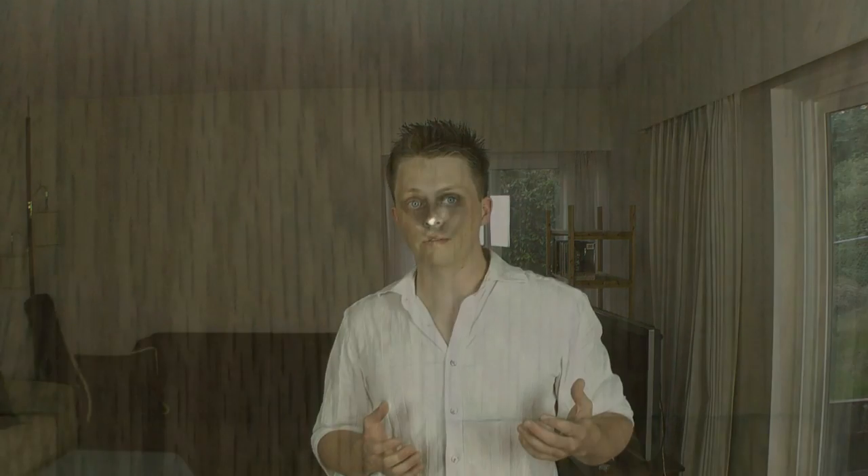This is because the magnetic field generated by a bar magnet is strongest at its poles. This is easiest to see by actually playing with a bar magnet and experiencing it for yourself. The field of this tiny magnet is along this axis. Notice how no matter how I try to approach it with a piece of iron, it will always spin so its pole gets pulled to the iron and not to the side. So there you have it: an easy, non-destructive way of finding out which bar is the magnet and which one is the fake.